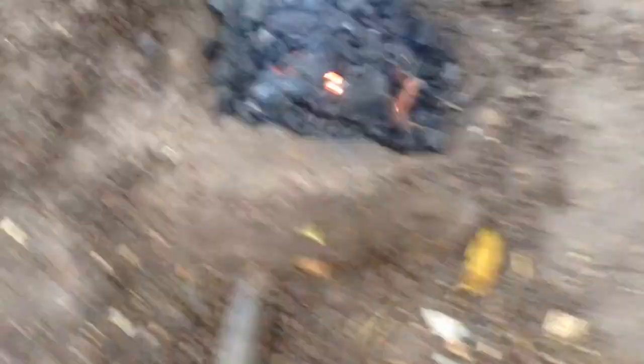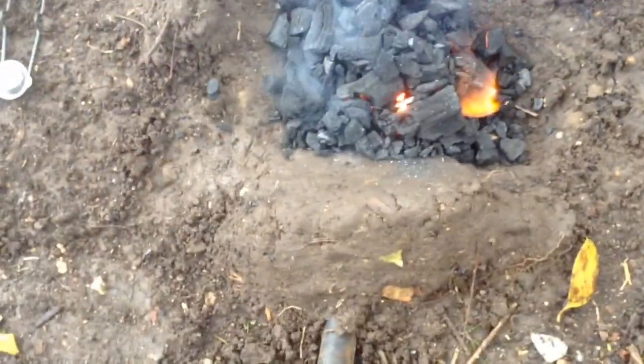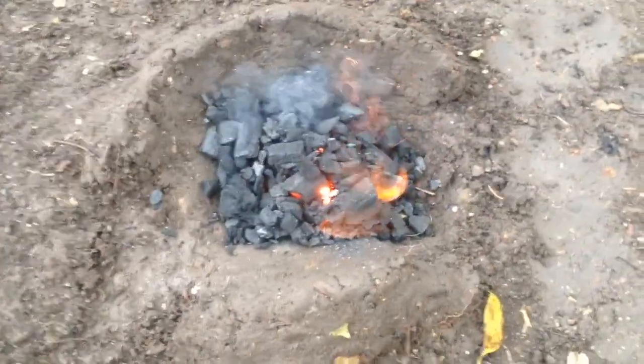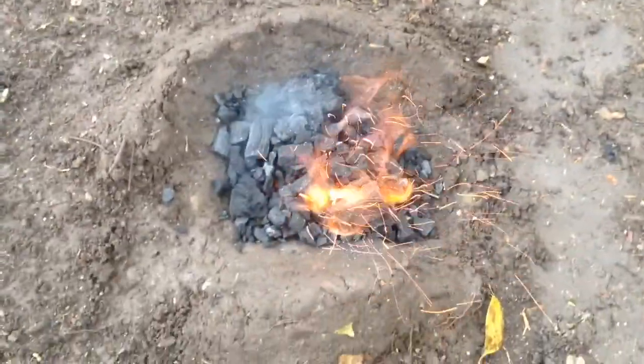Hazel! Hazel's hot! I lit the forge with a propane torch, and I had this old blower kicking around — it's a very small blower, you could probably use a hair dryer. I just duct-taped it on, and it seems to be working. You can see the very hot coals in the middle. The blower has an on-off switch, so if I turn it off, it cools down the fire significantly. I'm just gonna let that run a while, get it up to heat, and then throw some rebar in there and forge something.